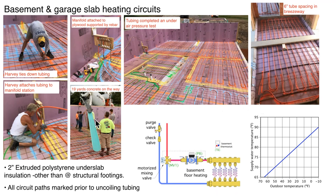This is the morning of the pour. The concrete crew set up using what I think is a 12-inch piece of PVC pipe as a chute extender, allowing them to back the truck right up close to the wall and run the concrete right down through the chute. The entire basement has two inches of foam insulation under the slab. The only exception is where there are bearing footings — there's a center bearing wall with no foam, and the concrete slab is thickened at that area. There's also two inches of foam along the entire wall.